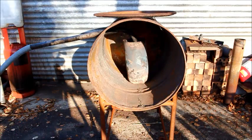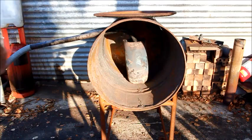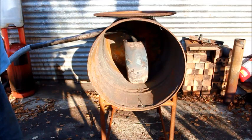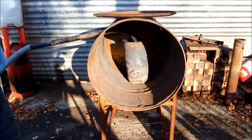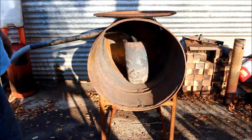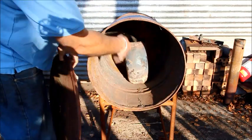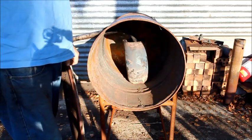As you can see, the burner's inside the air pipe — nearly comes through with the hole. You could use a hole saw for that, but what might even be easier is to use square tube. It doesn't really matter whether it's round or square, as long as it's feeding the air in.